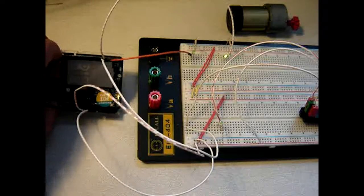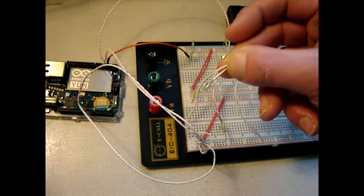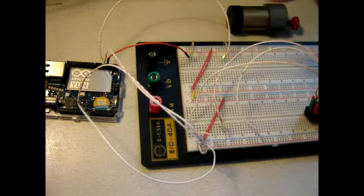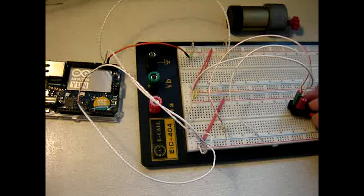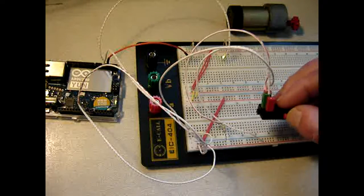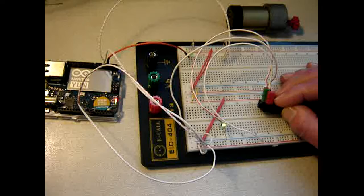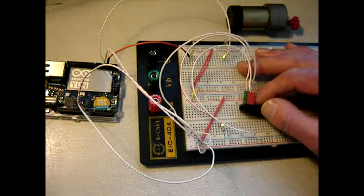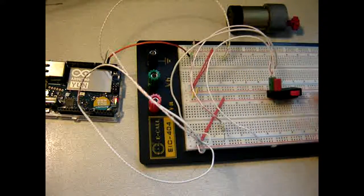So it is now time to check what pin 3 is doing in the code. Because logically speaking, if this LED isn't working and this LED doesn't do anything, that is physically unlikely. So yeah, let's test with one more. Pressing the switch. Oh, and the character, I have to enter more characters. Choosing letter H now, and yeah, the red LED is burning, this LED is burning, but this one doesn't do anything. So up to code.